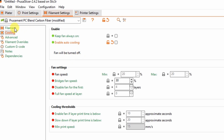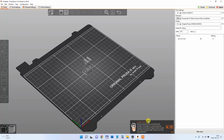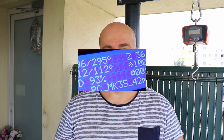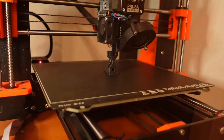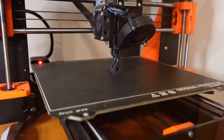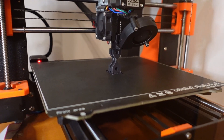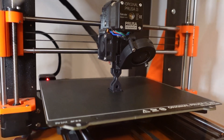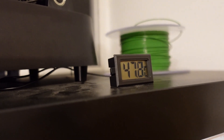I will reprint those test specimens printed vertically for the layer adhesion test with the smallest cross section area of 4x4mm. I will print everything at 295 degrees Celsius, I got a suggestion to raise the temperature, and I will completely disable the fan and print everything inside the enclosure. I reprinted the vertical test objects on 295 degrees Celsius, this time on a textured PEI sheet without any glue stick or other adhesives, completely turned off the part cooling fan, and closed the door — inside the enclosure the temperature is 48 degrees Celsius.